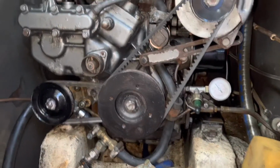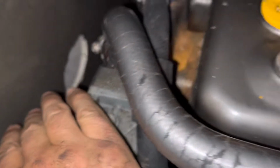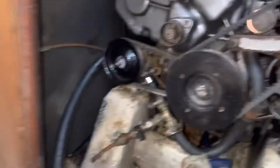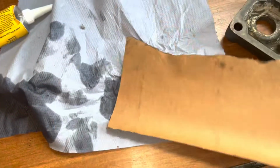That is what I've removed from the front. The impeller's gone back on, the zinc has gone back on, the thermostat's gone back on there, and the only thing left to do is put the rear zinc back on. Unfortunately, the gasket that came for that was the wrong size, so stand by for the next video where we figure out how to make our own gasket.